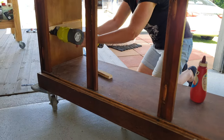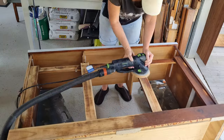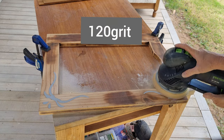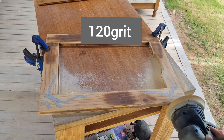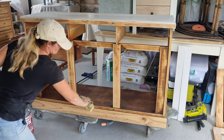Once all the repairs were complete, I gave it a good clean with Dixie Belle White Lightning. I then followed that up with a rinse off with water. If you clean your surface down before sanding, you'll avoid grinding the dirt into your surface and also into the pad. As the pad gets hotter, the dirt will melt onto the pad and then create swirls. So giving it a good clean beforehand will not only save you money, it will also save you time avoiding that extra sanding.